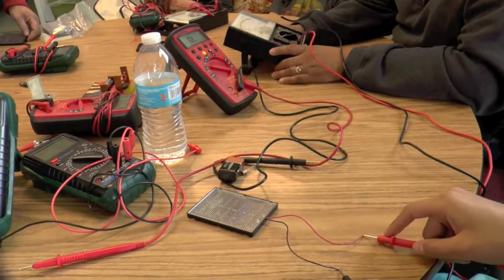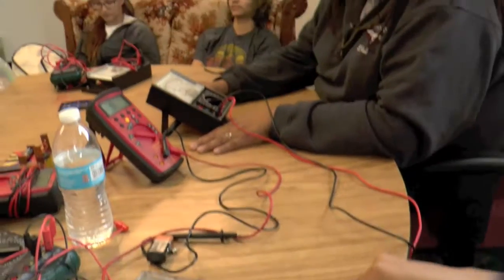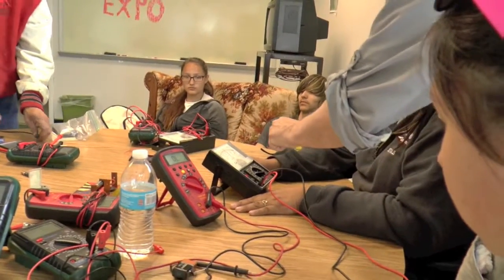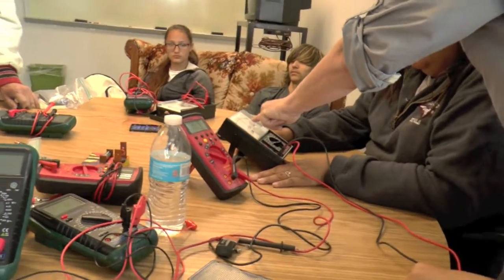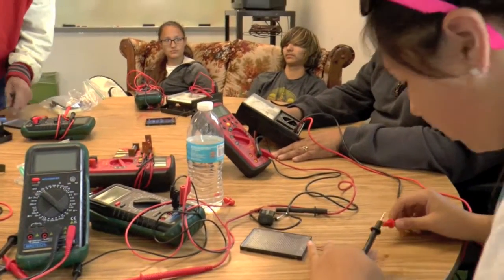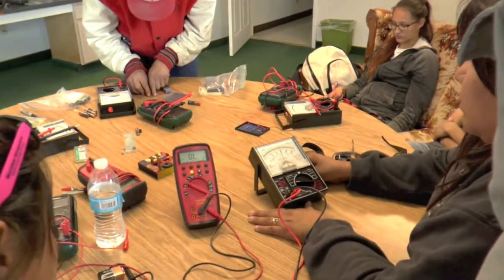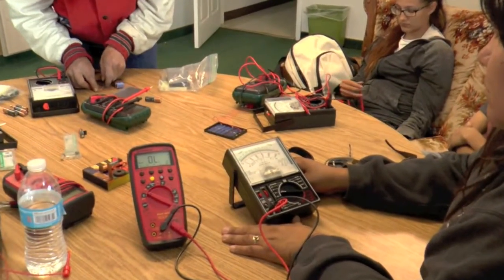The analog meters were antique — oh, they're moving! It's working, very little. What do you got there? Out of range — you're at the 10-volt range and only getting like a couple of volts, not even one. Drop it down a range, you get a little more activity. You've got to consider you're looking at the top scale: we're at 2.5, this one ends at 250, so we do the decimal thing in our head and we've got right around a volt on that one. It jumped up — about 1.9 volts on that thing.